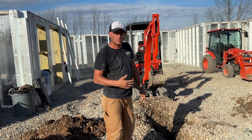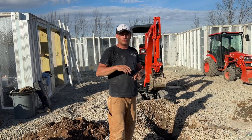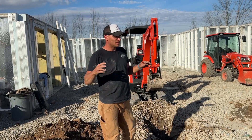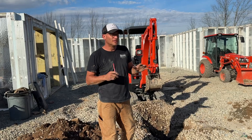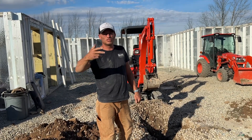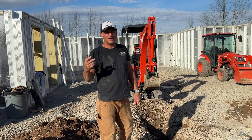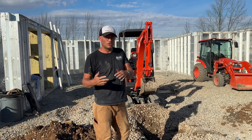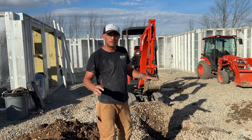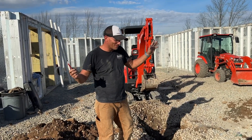Everything needs to be vented but you can use a wet vent. Plumbing is subjective — if you're in New York City, Philly, northeast PA, or Virginia, everyone has a different code. This is fortunately IPC, so not everything needs an individual dry vent. I can have some wet vents, which is a lot easier. My plan was actually a little overkill but I took my master plumber buddy's advice and we simplified it. Go ahead and roast me — that's fine.